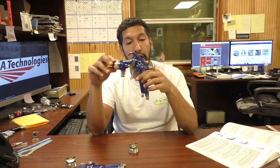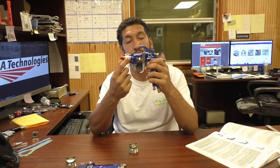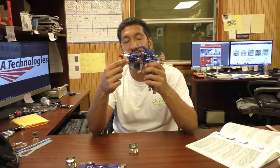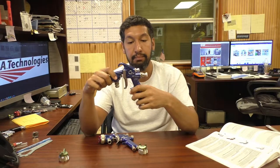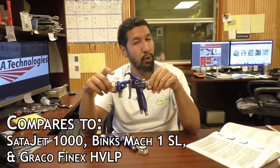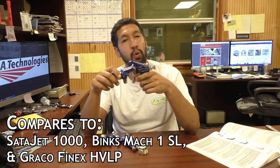For people with a little smaller hands, this might be a little more comfortable, which is a plus. One other difference — this one actually comes in at a lower price point than the original CPR. The reason for that is this is about a 50/50 mix of aluminum and stainless steel fluid passages, so it's not full stainless like the CPR is. But it can still spray waterborne products and your lacquer products — just keep it clean, especially if you're using waterborne. This gun is comparable to like a Sata Jet 1000, and the Binks Mach 1 SL — also known as the Slimline.